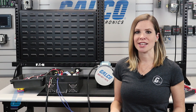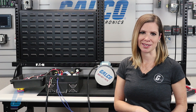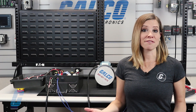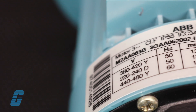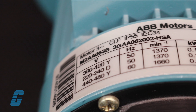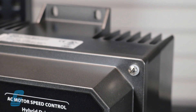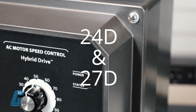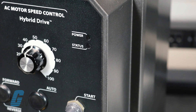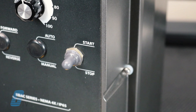If you are using GFCIs, refer to the on-screen instructions for your particular drive series. We'll then want to verify that the line voltage to be used matches the nameplate of the drive and motor to be used, then we'll set the jumper J1 to the correct voltage. Note that only the 24D and the 27D drive will have this J1 jumper for selecting 115 volts or 230 volt applications.